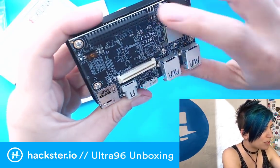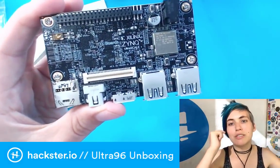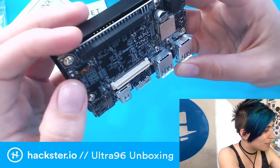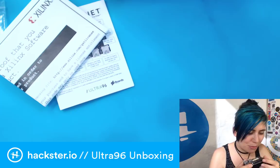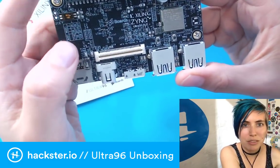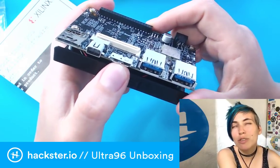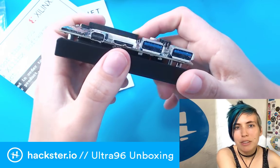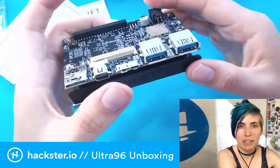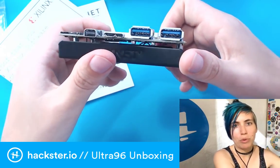There's a bunch of stuff on there. This has a ton of different ways to plug stuff in. Not only are there the mezzanine boards I mentioned before — the basically little daughter boards — where you've got Grove connectors and things that you can plug in, as well as a bunch of sensors. You just put the little micro SD card in with the OS on it. There are a couple of dip switches with some Kapton tape over it. There's a little mini DisplayPort connector, and you've got three USB ports. This one is USB 3.0 micro Type-B — it's your upstream connector that allows it to connect to a host computer, and then these two allow you to connect peripherals to this board. So you've got three USB 3.0 ports.